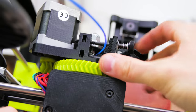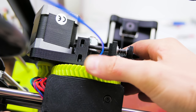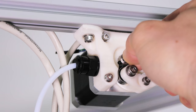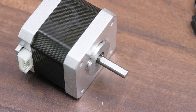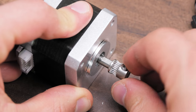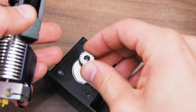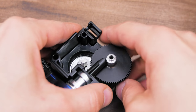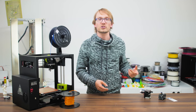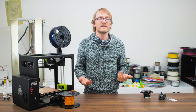So next up for the extruder, it's geared versus non-geared, also known as direct drive — and actually that decision is rather simple. You need a geared extruder for 3mm filament, while 1.75mm works with a direct drive extruder for 99% of all use cases. Geared 1.75mm extruders that use the common full-size NEMA 17 motors are rare, with the E3D Titan being a notable exception. But the gearing doesn't hurt either.